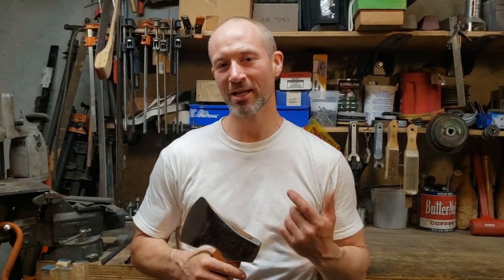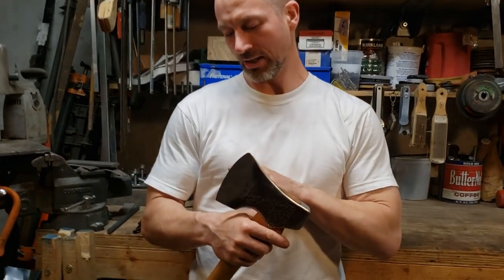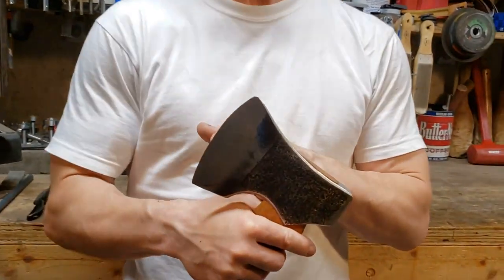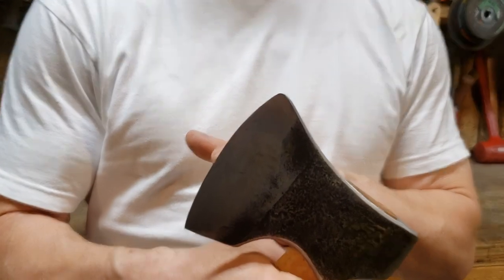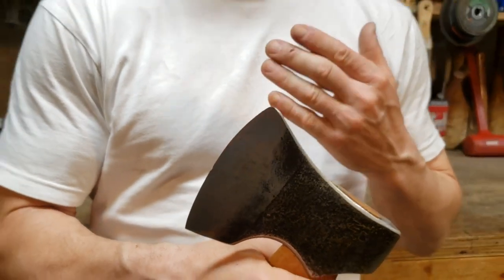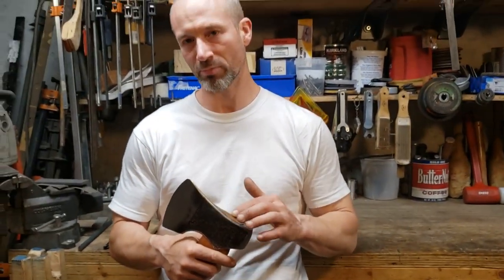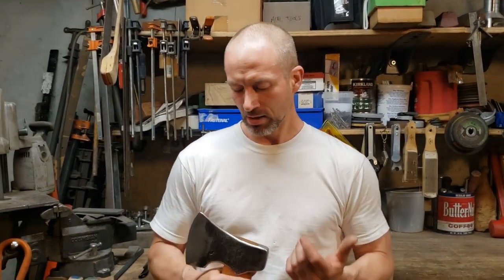Because that happens sometimes. There's a chip in the edge of this axe, which happened right after I did the final installation with the top wedge. That's the kind of thing I hope I'll find out during the testing phase, when I test before putting the top wedge in. This particular time didn't work out that way, probably because I was doing some heavy hewing on dry Osage orange, which is one of the hardest woods that grows in this hemisphere. So